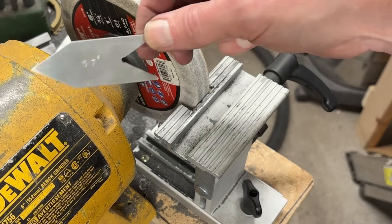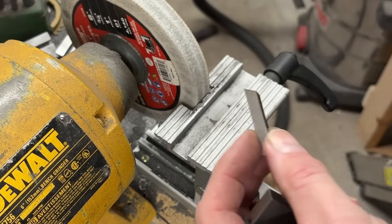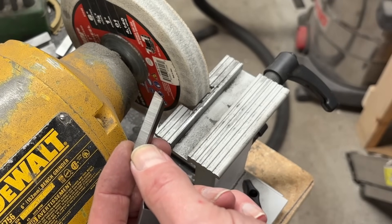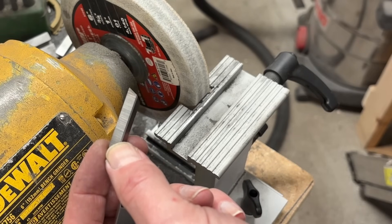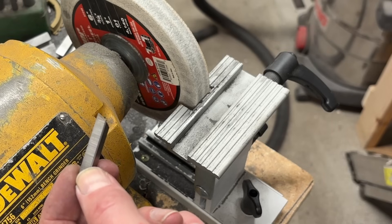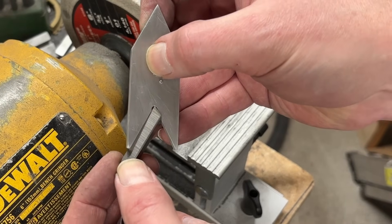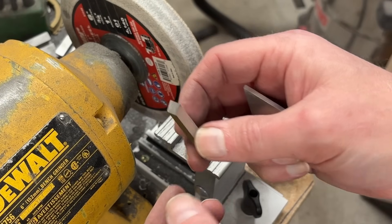The first tool that I made was this fish plate — you can see the 57 stamped right in it. The angle cut into the high-speed steel is 57 degrees. I had a 55-degree and a 60-degree fish plate, and 57 degrees is almost halfway between the two. I used those initially to get my settings and they worked fine, but I thought: why not use the correct fish plate? So I ended up making this one, and as you can see we get a nice tight fit that lets me double-check that everything is set up correctly.